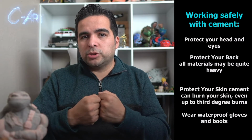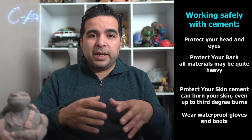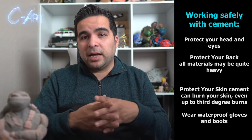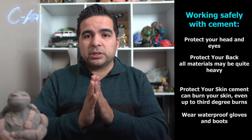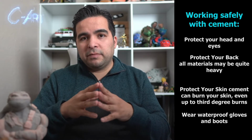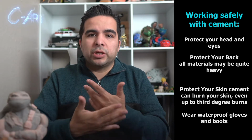I know I didn't need it that much, but for sure, if you have cement that touches your skin and you leave it for a certain period of time, it will absorb the moisture. It will burn you. There are people, you can Google it, that work with cement and they have damage on their skin that is the same as a third-degree burn. So I have more respect for people that work with cement now, but for sure be careful. And if something like that happens, have a bucket of water close by so you can rinse your skin.